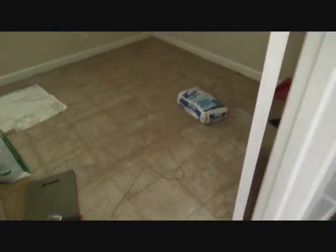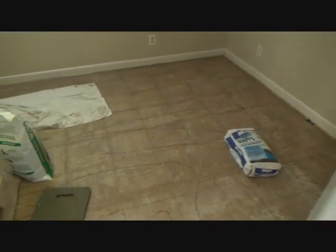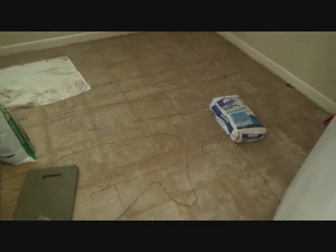And my experience has been down the road that usually when you see a black tar substance like this, usually the tiles that are installed over the black tar are VAT tiles. That means vinyl asbestos tiles. Nowadays they don't sell that. They make VCT, vinyl composite tiles, VCT.